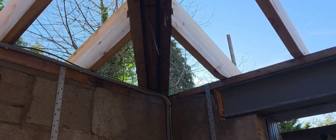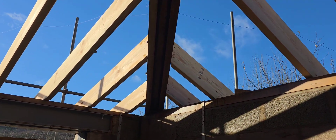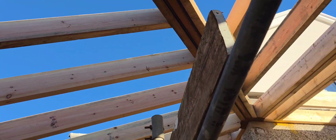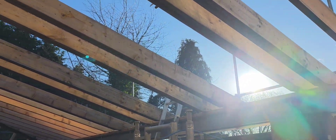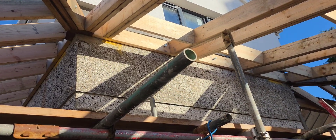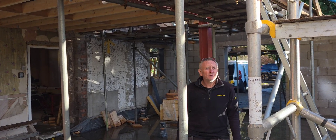You can see what Nigel's on about with the bastard hip — it doesn't actually join in the middle, it's over to the left-hand side. There we are — you can see that's off-center. Same setup with the padstones over there. Nigel mentioned that keen-eyed viewers might notice it's screwed — he's going to come in with the nail gun and nail it as well. In his next job, Nigel's putting the chemical fixings into this ledger plate, bumping all the double rafters as per the drawing — no corners cut. Then it's ready for the roof covering to get it watertight.